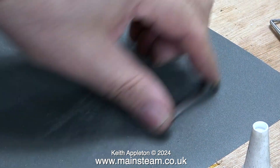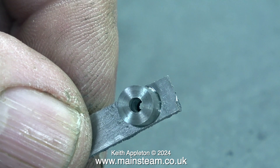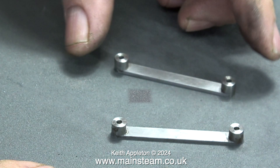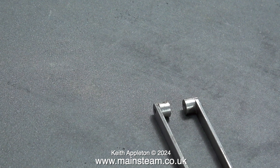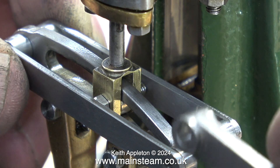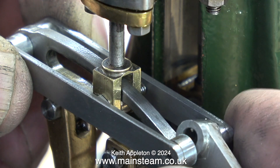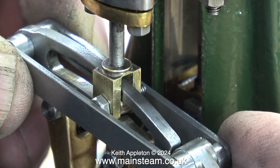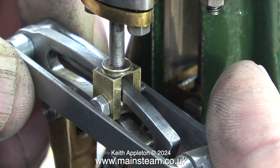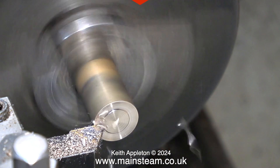As well as making the parts look good, I'm making sure that none of the barrel sticks out the other side. Time now to trim off the excess at the end of the bars — a very easy job, first using my bandsaw, followed by my one-inch belt sander to remove all the tool marks, then polished using the polishing spindle. I've reduced the width of the two barrels only at one end to allow the drop arm to fit in between, because the drop arm is wider than the expansion link.